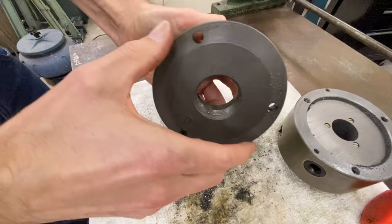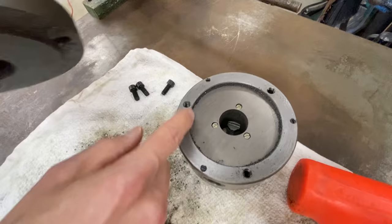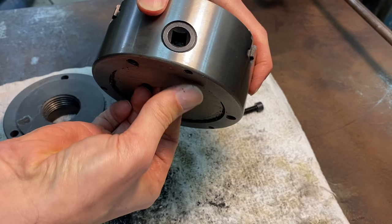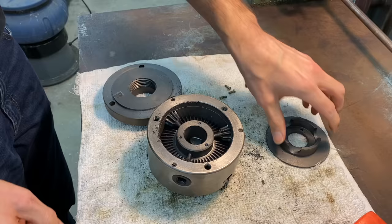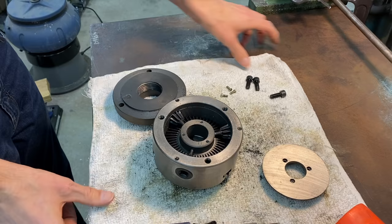We're going to make this lip a little bit deeper and a little bit smaller in diameter so that it has the ability to float inside the recess on the chuck. This slides out — some are really tight, this one's a pretty good close-tolerance slip fit. It's just a cast iron part. You can see the scroll in here, the gear on the back of the scroll. One option is to put your adjustable set screws in here, but what I've been doing is not putting that plate back in, or using something thinner to give more room for adjustment.